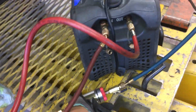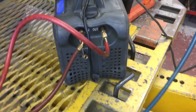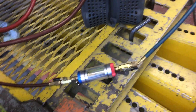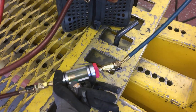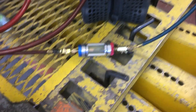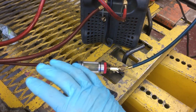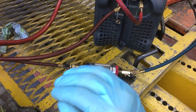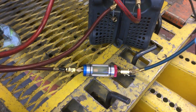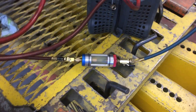That is it. I just wanted to show you on this particular recovery on this vehicle that no oil comes out using the machine. I'll see if I can capture some more later on another day where I get onto one of the systems where it pulls out a lot of oil, depending on where you're hooked up. Not all AC systems are constructed the same, and they don't all perform the same or have the same reactions when performing a recovery - whether yes they do pull out oil or no they don't. See you guys later.